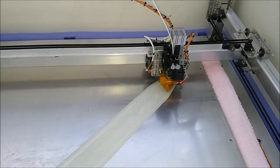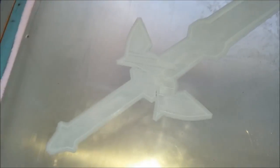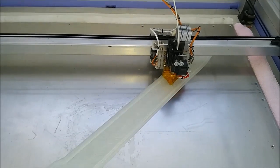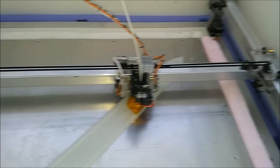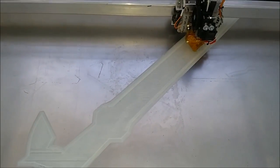The first layer's gone down quite well. Also worth mentioning, the printer is doing an 81-point bed level — so I've got a 9x9 grid for bed leveling. I've also insulated the sides of the bed with some towel and some timber, just to try and keep the heat a bit more stable. That's helped, and the bed's a bit flatter now.